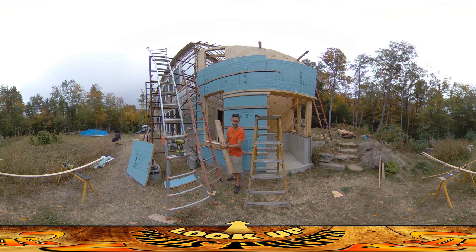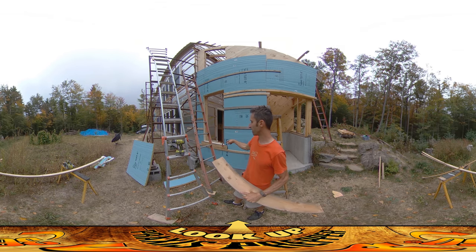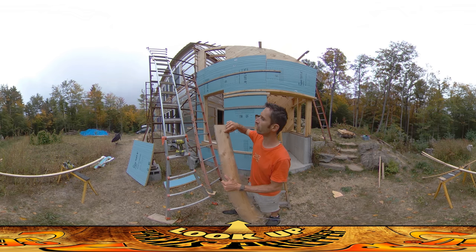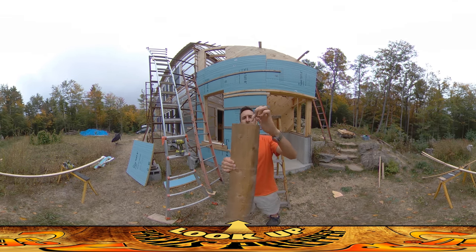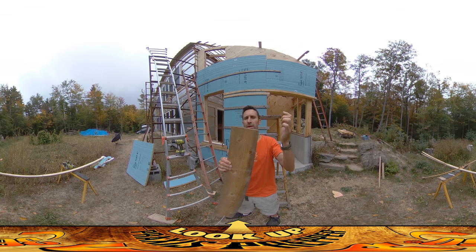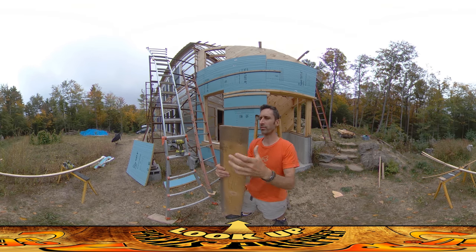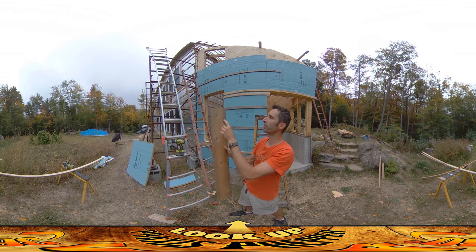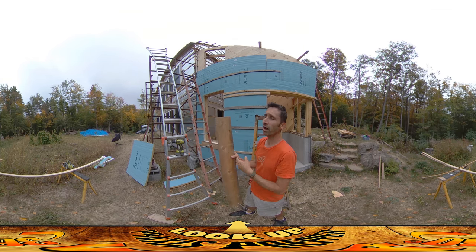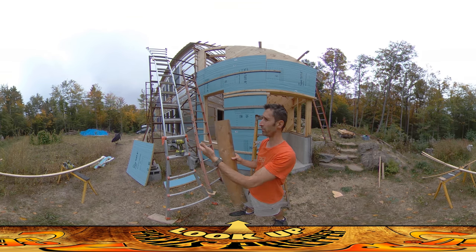I did the top and the bottom at the same time — I cut the two boards and then I drilled through both of them. I presume I had the other one on top when I did it, because this drill hole is in a really terrible place. It's right in the middle of a crack. There had been a nail here at one point, and it cracked the wood — there's still an obvious weak point there, and you can see it flexing when I flex the board. So if I were to put another nail in there and try to nail it up, this would almost certainly crack.